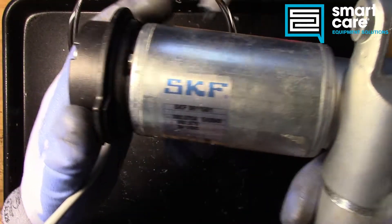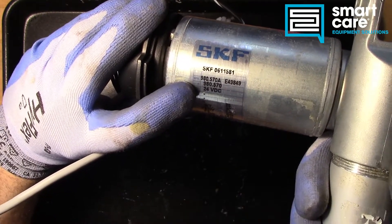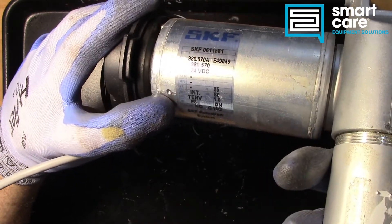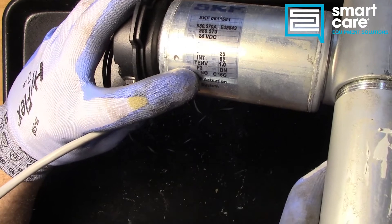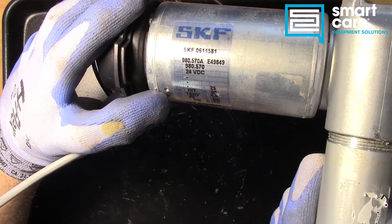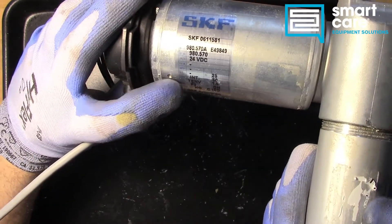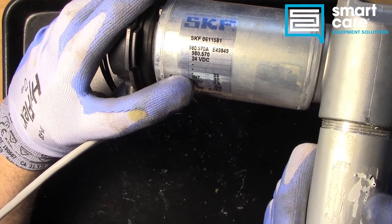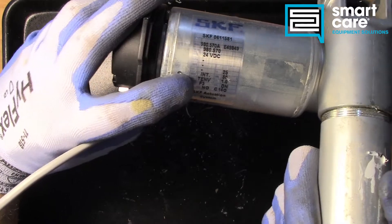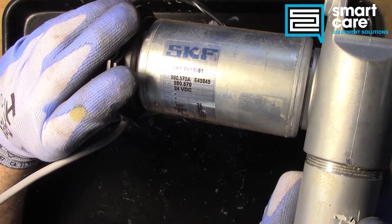When we look at the data plate on this, we see it's 24 volt DC. There's a lot of other information on here, but it's not entirely clear what it means. It says it has no thermal protection — that one's pretty clear. But a lot of the other data doesn't really tell us what it does. We do see one here for duty — it looks like intermittent duty, so it's designed to move at an interval with a cool down in between. It is not designed to run back and forth continuously.